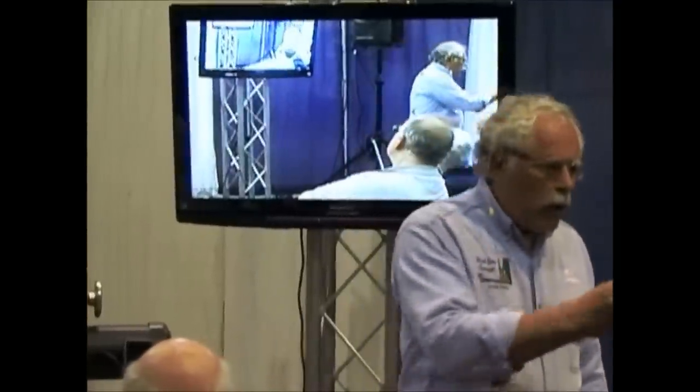The third thing you have to consider, and this was mentioned, is equipment. You have to know what kind of equipment you're going to be having. If I'm doing a 24-inch platter and I have a Delta mini lathe, I'm going to have problems. So I always have to find out what the swing is, what the size of the lathe is, so I can bring a smaller blank if I'm doing a multi-axis platter or something like that. I usually bring my own chucks, but then I make sure I have that adapter for the Powermatic. I'm going to need that 1 1/4, etc. So you want to know the equipment.